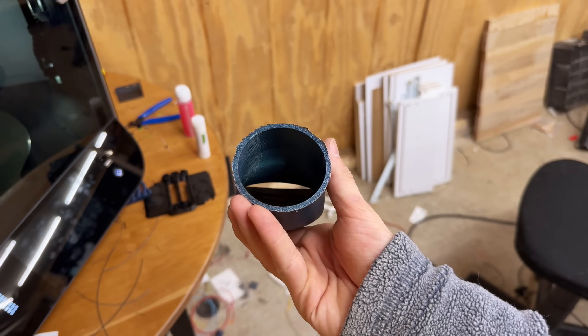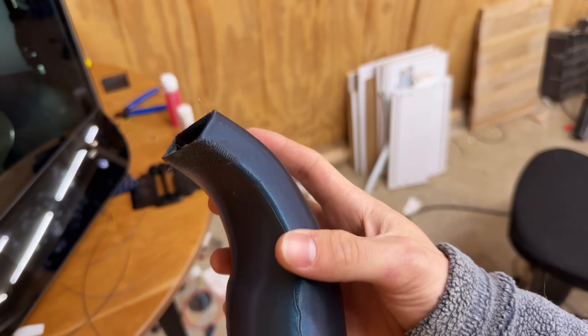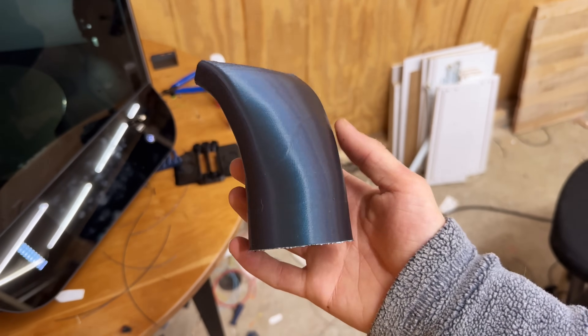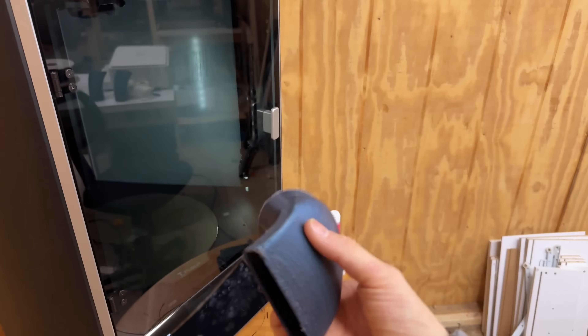Not bad overall, except this one needed a 10 millimeter brim around the base, and the overhangs look a little worse. So their ASA settings definitely need some tuning. With PLA or PETG, this thing is twice as fast as any other machine I have here with the same quality — I can get a Benchy done in 10 minutes. The ASA though, I'm having some hard times with it and I'm going back and forth with the FL Sun techs to get that dialed in. Carbon fiber nylon prints amazingly on it. We're going to throw some ABS in once it dries to see if that behaves differently.